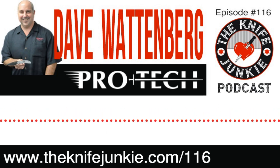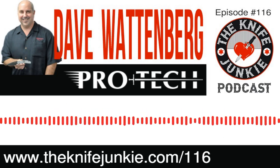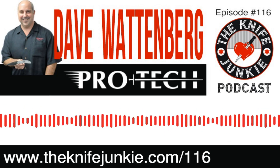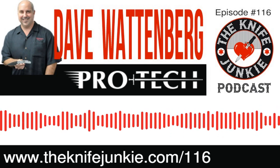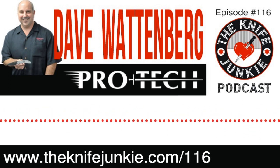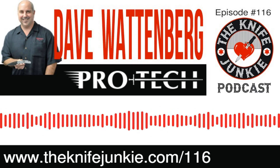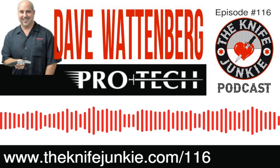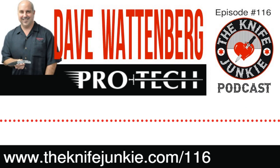What is Bruce Shaw — is that an engraver? He's the engraver we partner with the most. I've seen videos of him working — I thought everything was done with a machine or laser until I saw him engraving some of your knives. He's hunched over with magnifying glasses — 100% amazing and legit. Now, please explain the difference between the Harkins double action and the double action out-the-front. It's a double action side-opening knife. It has a thumb stud on the blade — you can fold it open like a conventional liner lock, then use the liner lock on the inside to unlock and fold it closed. There's a hidden button in the bottom corner of the first carbon fiber inlay on the front. You press there and a leaf spring shoots it open. Then you use the liner lock. After it's been fired automatically, when you close it the first time, you'll feel the spring tension and have to reset the spring. Then you can open and close it manually with no spring tension — you won't know the spring is there at all. It's double action either as a regular liner lock folder or as an automatic knife, and unless someone shows you where the button is, you'd never know it.